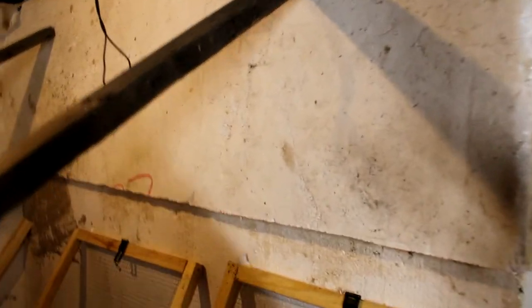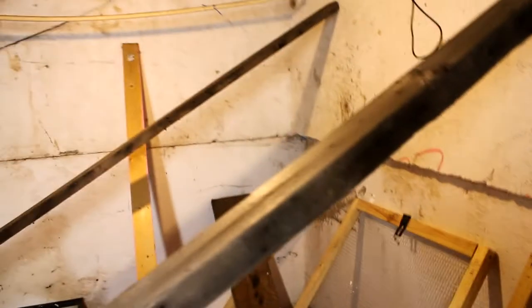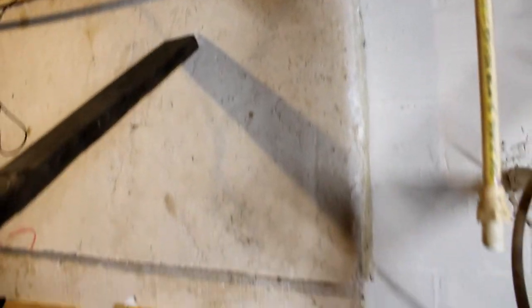That took longer than I expected — had to run to town to get some stuff. We're starting by taking these foam chunks and piecing them onto the wall, using a special foam board adhesive to stick it. I'm going to let this sit tonight to cure, then come through and fill the cracks and gaps with spray foam, mold it to look more like natural rock, and then mortar coat over it. See you guys tomorrow morning.